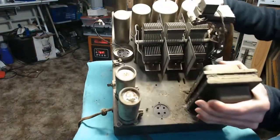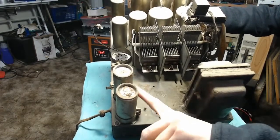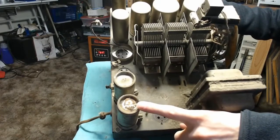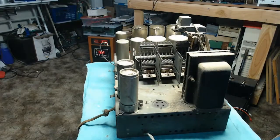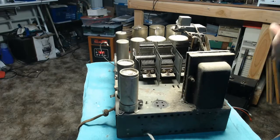At this corner right here, we have our two main filter capacitors — 8-microfarad deals. You can see this wonderful junk sitting on top that looks like bird droppings. That is the electrolyte. These things are filled with a fluid, and that fluid goes bad — it dries up. If the capacitor has a lot of leakage, it'll actually boil. There are little holes drilled in the top to release pressure. On the early ones, there were no release holes and the top of the cap would actually start to bulge as steam built up — because you were boiling the electrolyte.